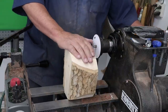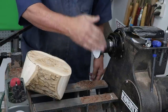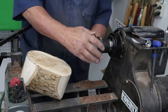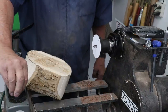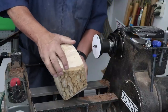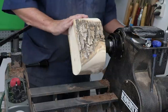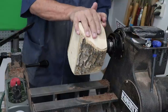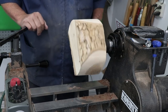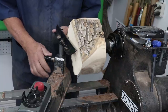I'm going to use my Sweet 16 Robust lathe — it's plenty hefty. I've got a 3⅛-inch screw chuck on this with a spacer, because ordinarily you don't need that entire thread. I'm going to turn my lathe on pretty slow — if you think this is not safe, don't do it. Thread that on until it catches, lock my spindle and crank that on. I'm going to try to turn this without the tail center support — I think this block of wood is going to be fine.